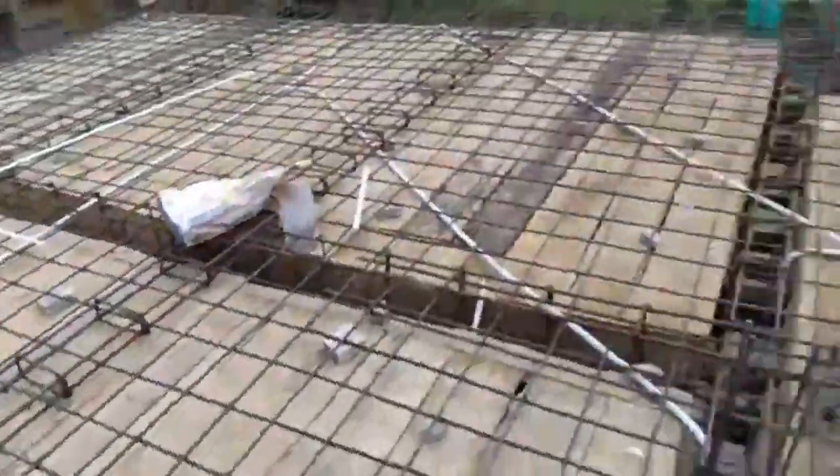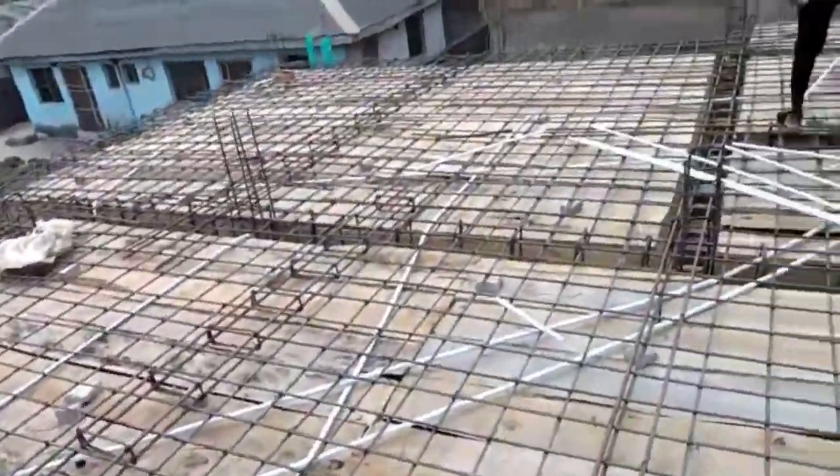Now the PVC pipes, they just started the arrangement of the electrical PVC pipe. All these are basic things that are supposed to go through. You see the steps. There was an ordinary plank there before. See the steps in position as it's supposed to be. That's the network of 16 mm iron rod, because the step carries a weight when you're walking. Children might be running up and down. So that's 15 and 16 mm all together to network.